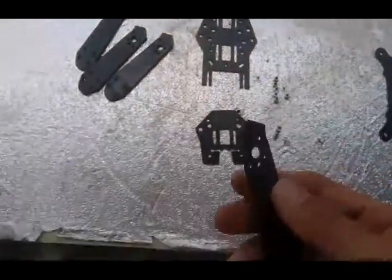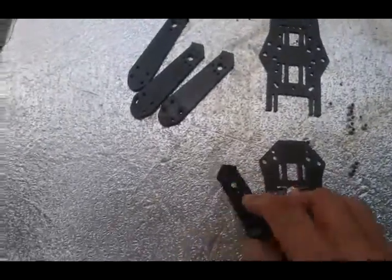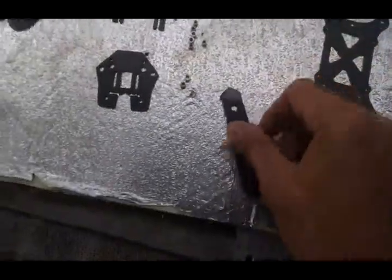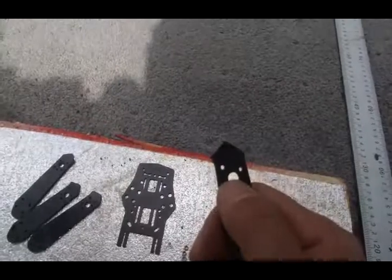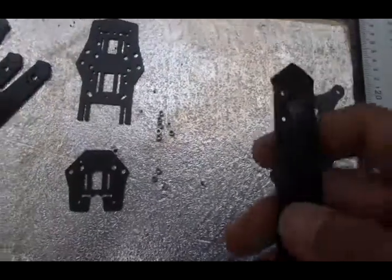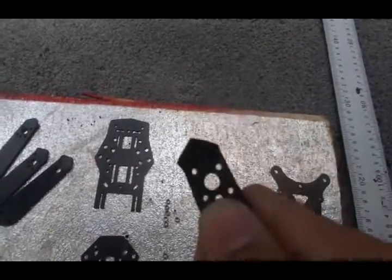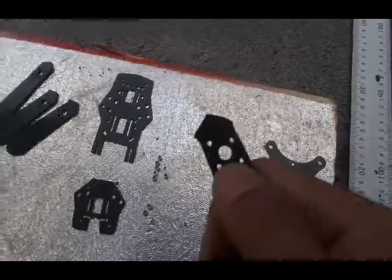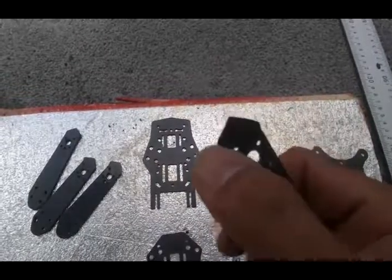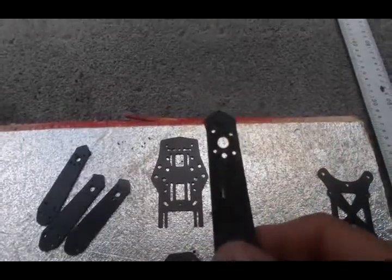All ZMR arms have two holes here unless you get the custom dowel ones. There were four standoffs to be used as legs. So, the very first hole from the motor on the arm, you enlarge that out to accommodate your shaft and circlip for the motor. This is drilled out for 1806 — 18mm across there and 12mm across there. That leaves those other holes untouched.